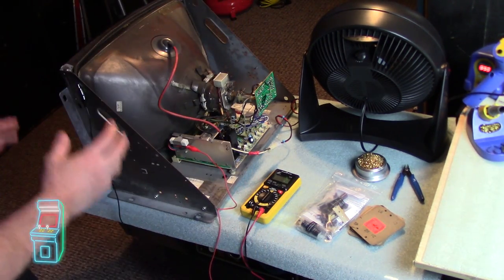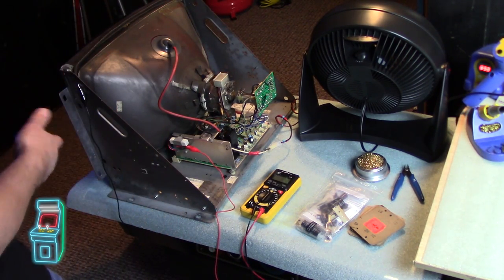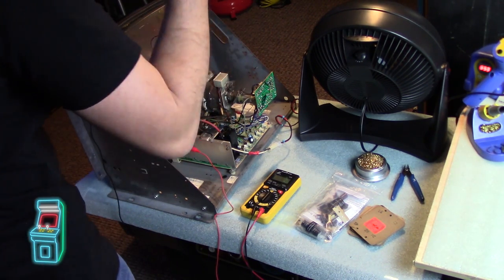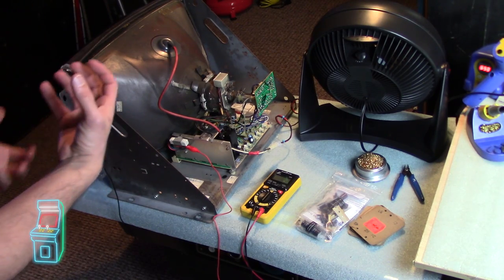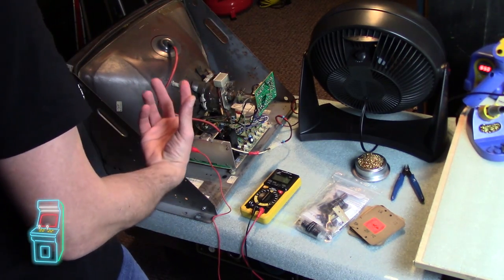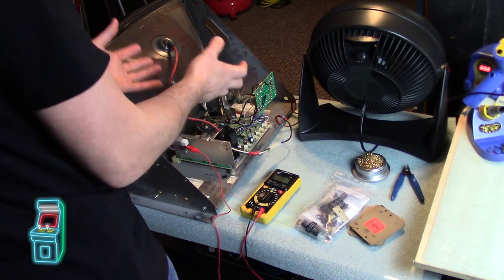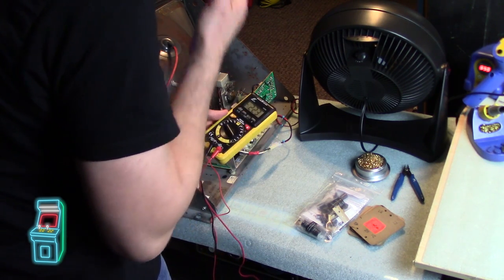These K7000 chassis are really cool - they're really easy to remove. It's a whole different story with, for example, the K4600 with the cards - that one's like a nightmare to take apart. It is possible and pretty cleverly designed, but it is a pain to cap because you have to take the whole thing apart. When you're putting it back together it's also a big pain. This one you just pop it in and test it - it's just easier.